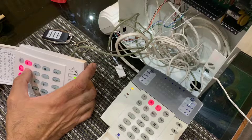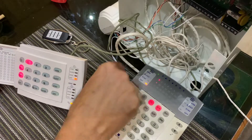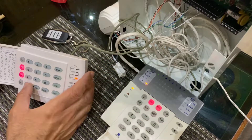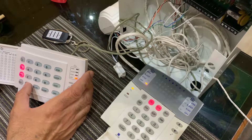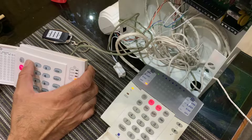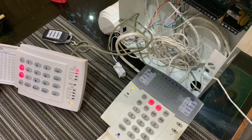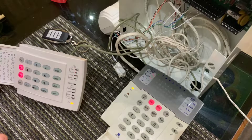I need to disarm the system. Now I'm going to put it back to the way it was: hold down the clear button until you hear a beep, then release. If I arm the system again, you can see it starts beeping and once it reaches the last 10 seconds it's still beeping — so now it's back to normal. This is how it should be.